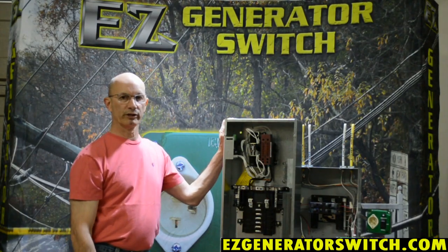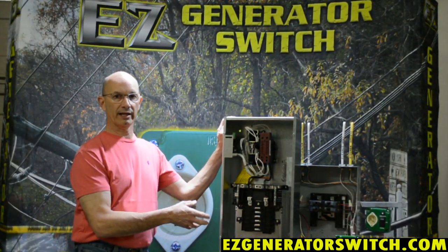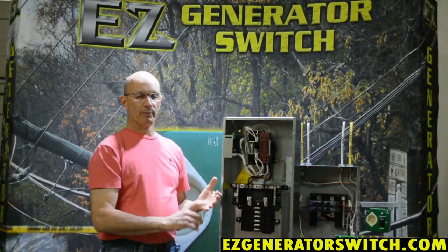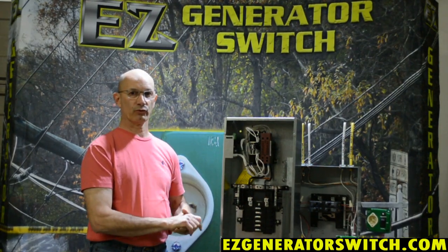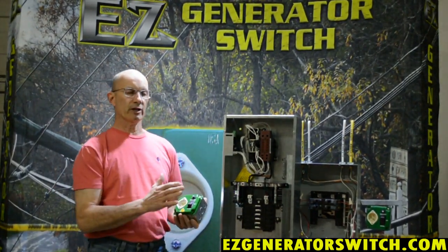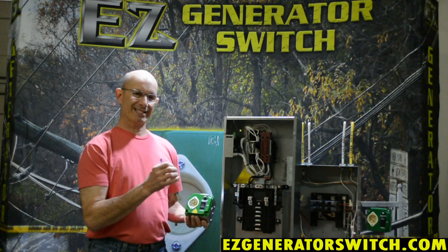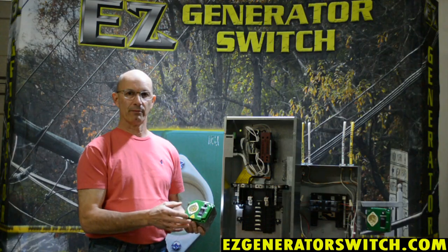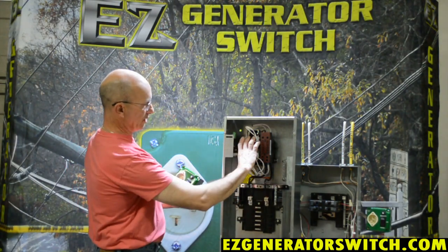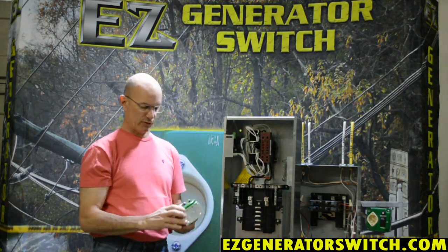We do them in all different sizes. We're actually doing one tomorrow that is a 20 kW generator and it's going to handle a 200 amp transfer. So the mechanics, the money, the time — everything involved with an automatic transfer switch is nothing like our small manual transfer switch. The whole purpose that we designed this was for our customers to get their essential loads turned on for the least amount of money. And in doing so, it has to be manual. As you can see, this is one circuit, but the size of the controls for this transfer switch alone is bigger than our whole single circuit transfer switch.